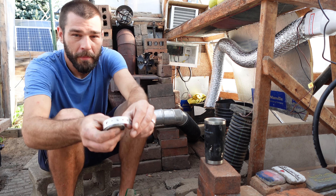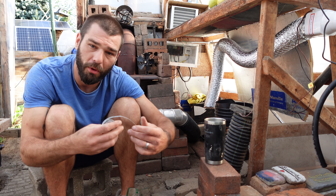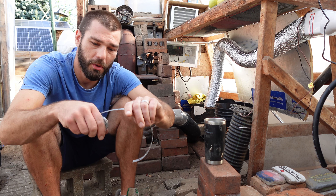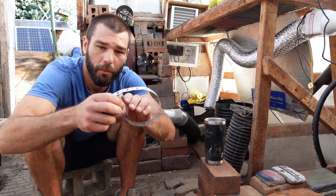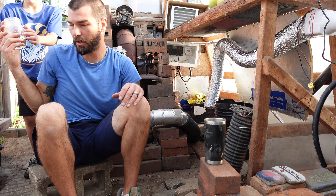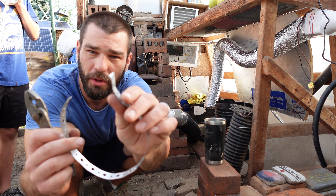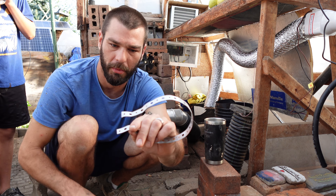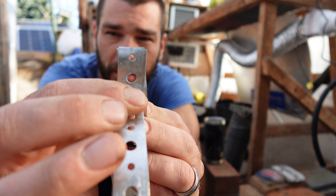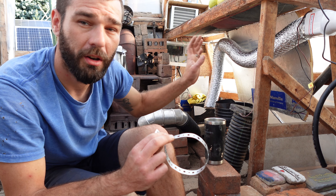Break time is over now. So I showed the little wire hanger. This wire hanger is like two or three bucks for a bag — it's darn cheap. I showed a bracket; it's very simple to just pull it apart and you've got yourself a wire ring that is going to hold, last, and be recyclable. What I like to do is take maybe the last two holes and bend those flat. We've made ourselves a very simple little bracket. You run a screw through there and you've got yourself a nice hanging bracket for any type of piping or tube. So I'm going to go ahead and tack this up and then we will finish routing our heating pipe.